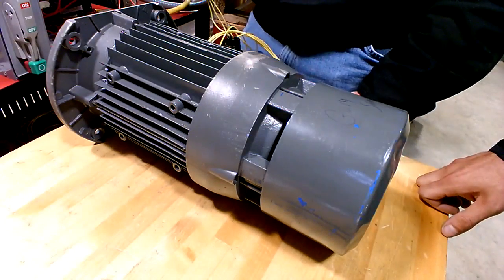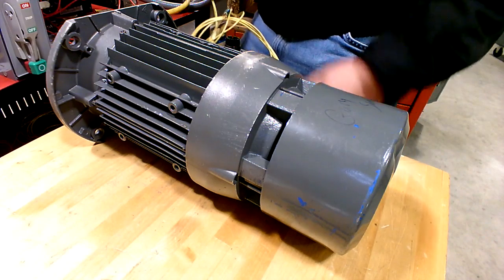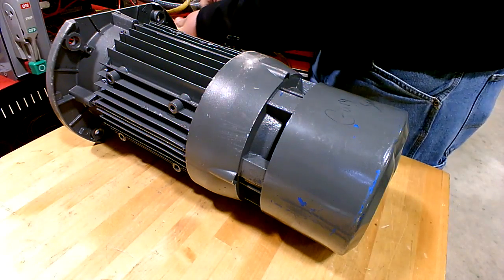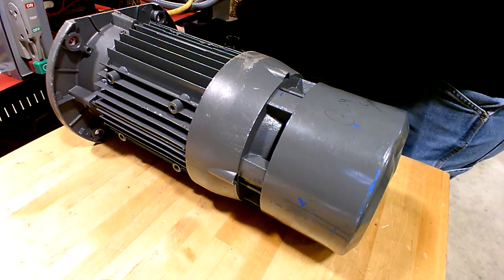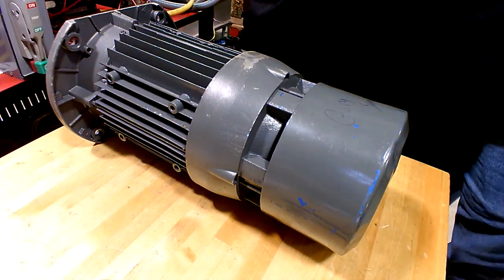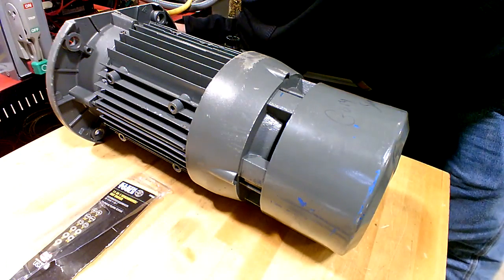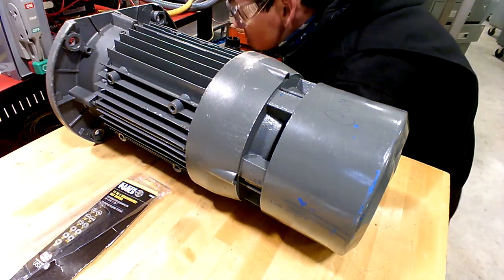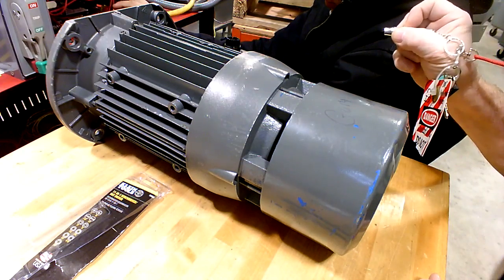And so we're going to shift over and connect the motor to the starter. It's actually going to go up in there to the bottom of the motor starter. That's the terminal strip there. Let me point, I'll show you. It's on the bottom of this here with the three terminals. You've got to go down in there. Right there, got those three right in there.